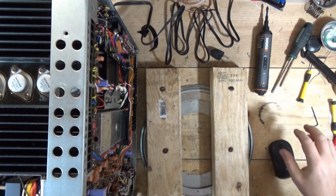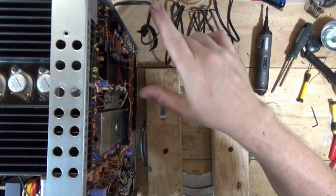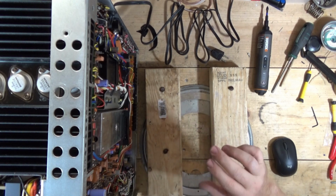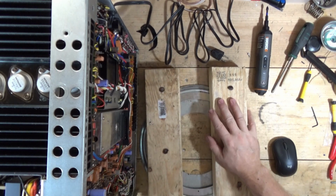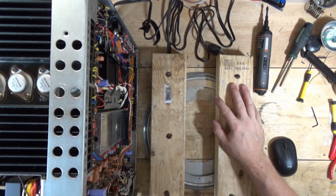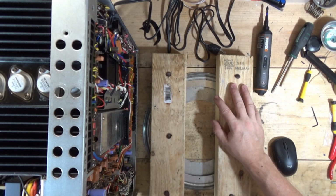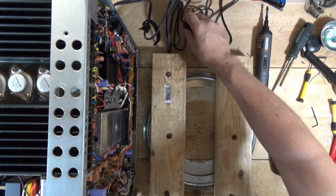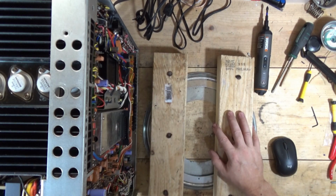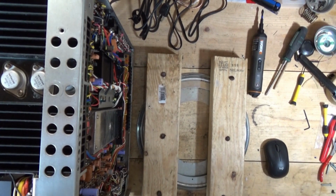So I'm going to go through, do the audio adjustment, the DC offset bias for the amplifiers, the voltage regulator adjustment, and if I run into any issues, I will let you know. Otherwise, I'm going to come back and probably flip this over, clean the pots, because I can actually show you that. And then I'll blow this out with the air compressor, do the cosmetic cleanup, and then I do have to replace the lamps on it. So let me get to aligning this.